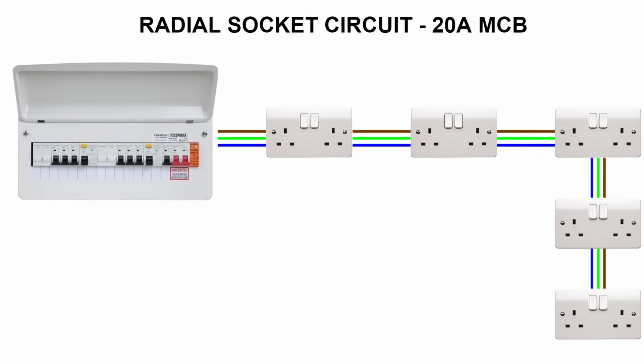The only place you would notice it is if you went along to the next socket in your room or on the circuit and plugged this in — you would then find there wasn't any power at that socket, assuming it was the live core that was missing.